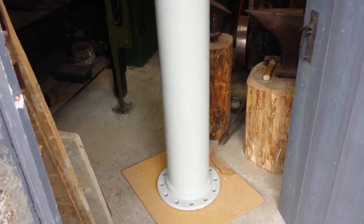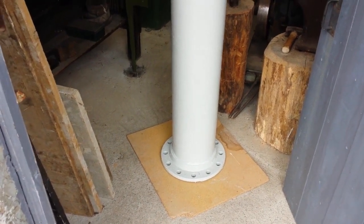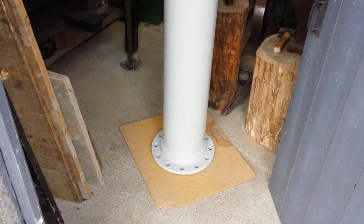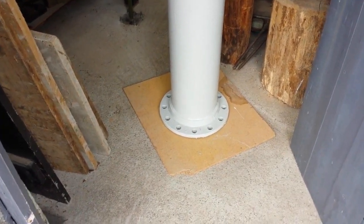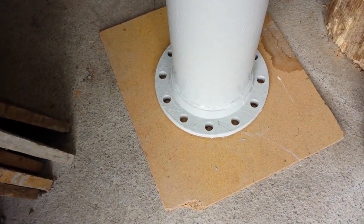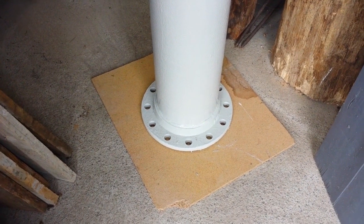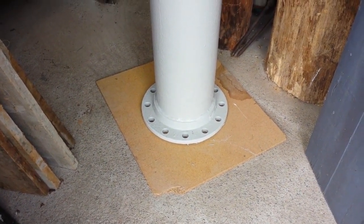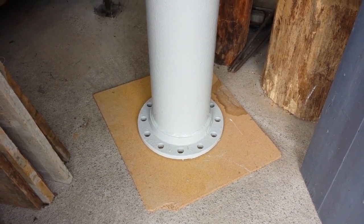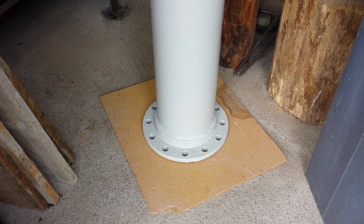But I'll explain the idea. The pier itself is going to be removable — I don't want it standing there all year round when I'm not here, so it's going to be put up when I'm here and want to use the telescope. What we're going to have to do is put a concrete block into the ground over there where the pier is going to be mounted, and protruding from that concrete block there will be six stainless steel threaded studs. The holes in the bolt circle are about 23 or 24 millimeters in diameter. The studs are going to be 20-millimeter stainless steel bar and there are 12 holes in the flange — I'm only going to use six. Partly because my builder friend raised an eyebrow at my wish to put 12 in, and partly because if we do make a mistake with one of the six and can't get the thing on, we can always cut it and then use some of the other holes to drill down into the set concrete and add another bolt that way.